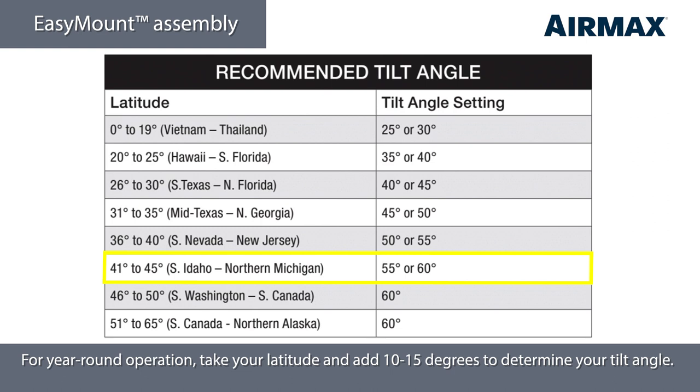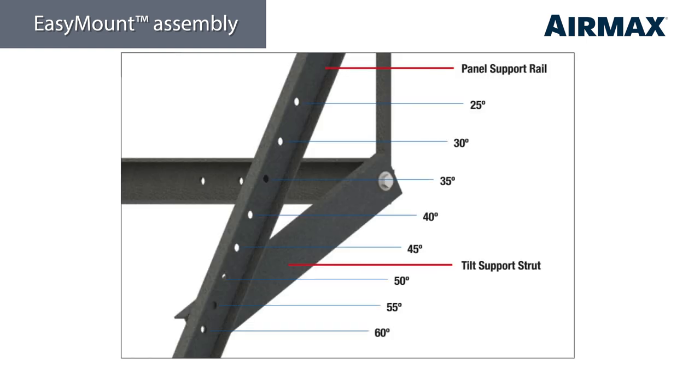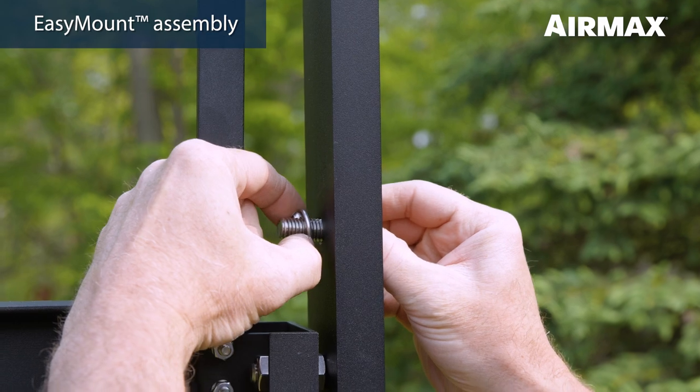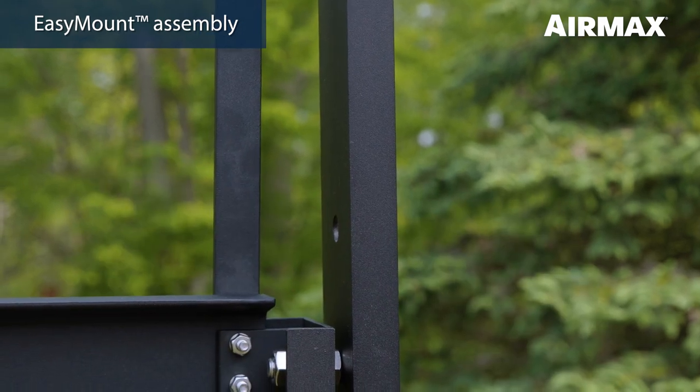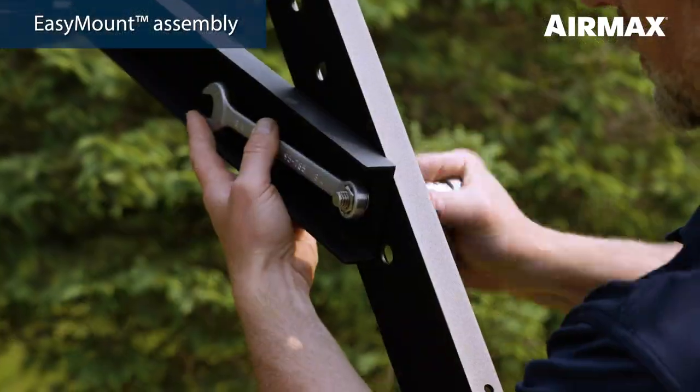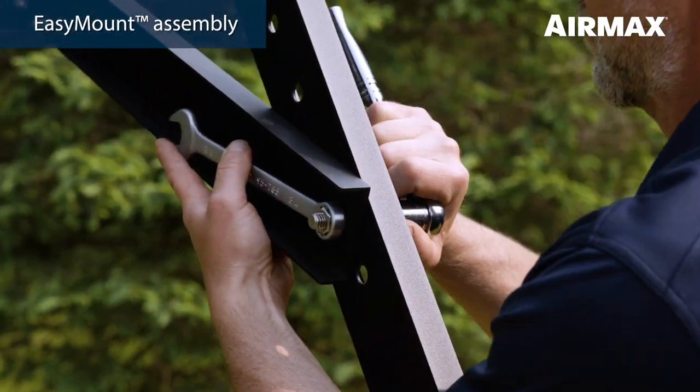Solar panels will receive ample sunlight during the other seasons, even when set for winter operation. Next, refer to the tilt angle settings in your product manual and attach your tilt support strut to the appropriate hole in the panel support rail. The angle settings are based off the difference from the horizontal plane. Remove the tilt support hardware from the temporary location on the support rail. Secure each support strut in place with the tilt support hardware and tighten completely using two three-quarter inch wrenches.